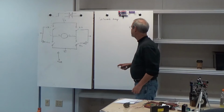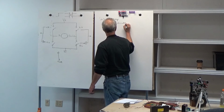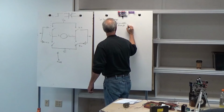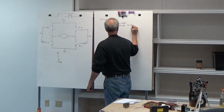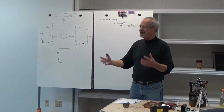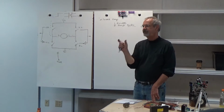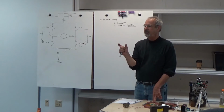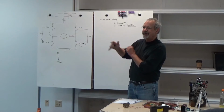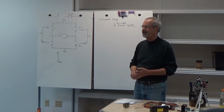So we have to have an encoder on each wheel. So we'll say encoders. We have to sample them at a periodic rate. This is really important, because a PID controller really is a filter. And for those of you who know filter theory, if we don't sample at a constant rate, we have to know the sample rate. We have to know dt, how much time has elapsed, and send that forward through all the equations. But if we can sample at a constant rate, we can ignore that, and that makes all the rest of the math much easier.